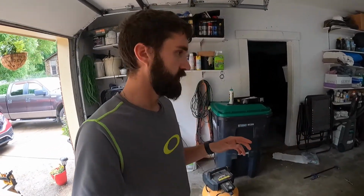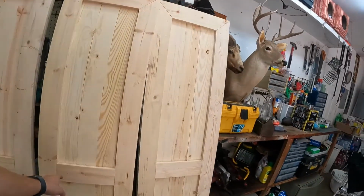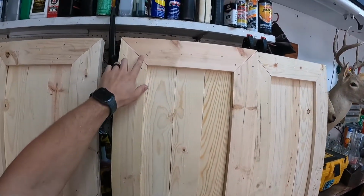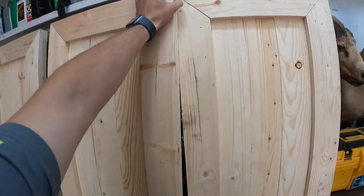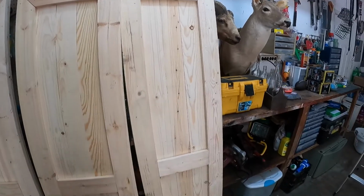So I'm gonna show just start to finish doing one of these. I've knocked out 3 of them so far. I might regret it. I should be putting glue behind these outside boards, and then these little gaps I'll hit with wood filler. That one's kind of pulling on me, but I'll hit those with wood filler, sand up the edges.